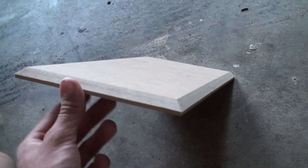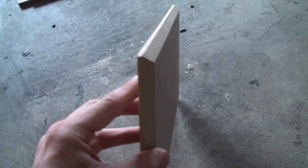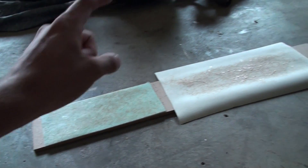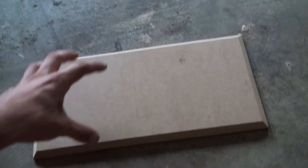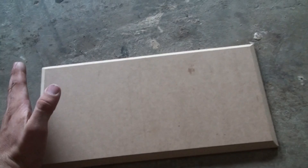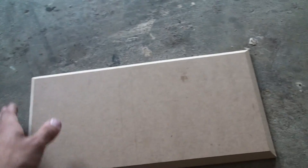I've put a 45 degree chamfer on the end pieces. I've cut my piece of foam so it's only in the middle bit - not on the edges, because people have said to keep it away from the edges since when you stretch the vinyl it'll rip the foam. I've never worked with this foam before so I'm just doing it in the middle. I'm going to stick the foam to the vinyl first, then bring it over and line it up when I glue it on.